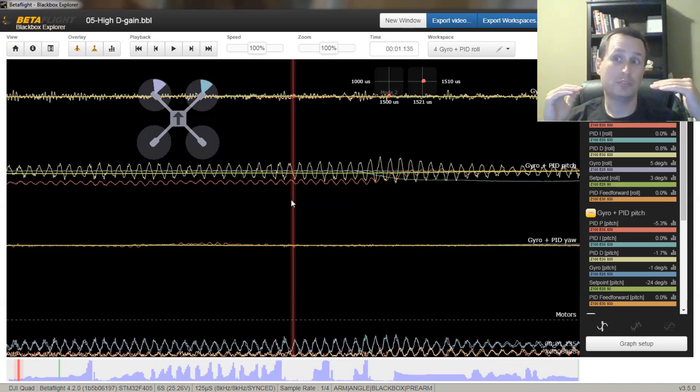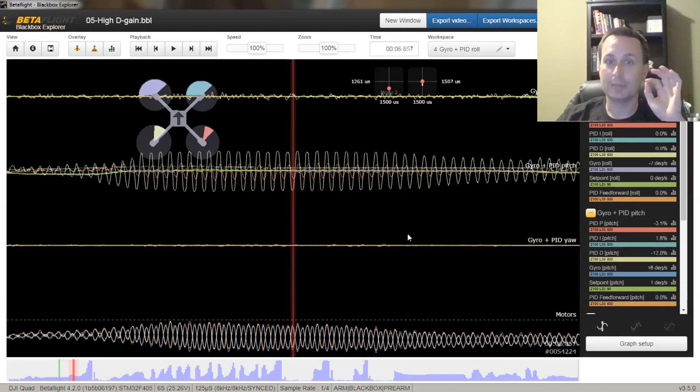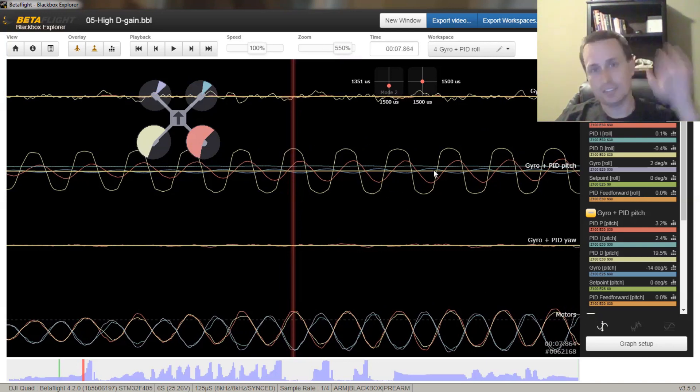And that's how you know you can't go any higher with your PD gains — because the P/D balance is locked from what we determined with flips and rolls. You can move the PD gain up to give the PID controller more authority, but you can only move it so far because the D-term starts to limit you. You'll start to get this trilling and oscillations — and it's a D-term issue. You've got to watch this because if you start to hear that in a flight, you need to move it down pretty quick — the motors can get really hot, really fast. That oscillation in logs is super easy to recognize because it's this perfect sinusoidal oscillation, not jagged noise — just sinusoidal up and down.